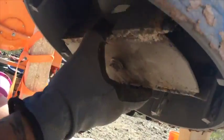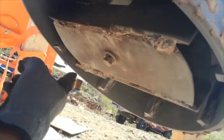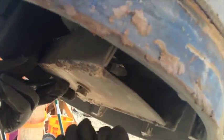The way this impact mill works is as this spins around at about 3500 RPM, the material drops down in the middle, comes flinging out the end, and it impacts these bars that are welded in all the way around here. That's how the material breaks down by impact — hence an impact mill. That's why you see all this wear in here.